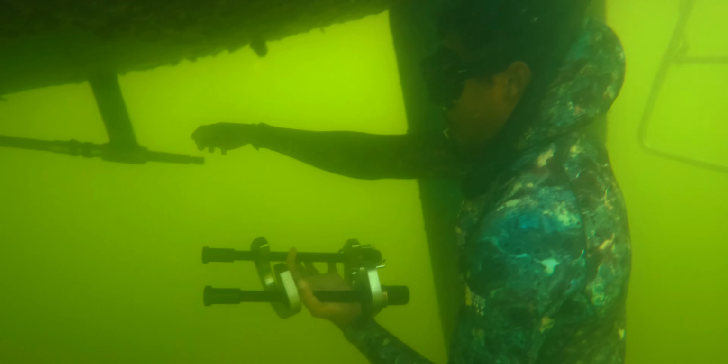Regrouping in the day because we successfully got off the old cutlass bearing, and so now we have to flip the tool around so that we can use it to put the new one in. How we're gonna do that? You wanna explain how we're gonna do that? So, on the back side, where the 1¼ would come out, we're gonna swap that plate to the 1-inch plate, so that way it'll line up directly on the bearing and push the bearing right back in. That'll drive the collets out, and our new cutlass bearing will be installed.